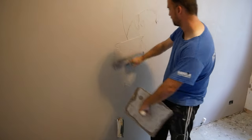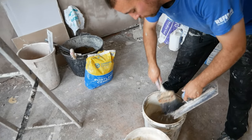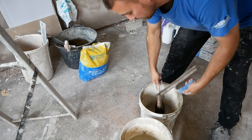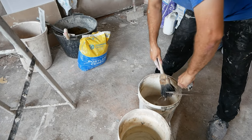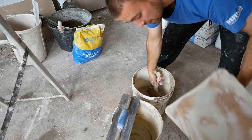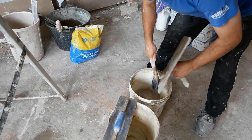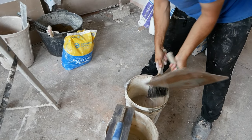We're always trying to go neater. I have all the second coats done, so make sure you wipe your trowel — both sides. Drop that back. We're actually finished with this coat, and we'll have everything smoothed out nicely. If you do need to put a light drop on, then you can wipe it again. Also make sure to wipe the back. Keep the weight down. Make sure your buckets and equipment are all clean now that you're finished with that coat.